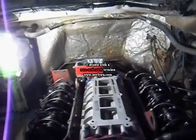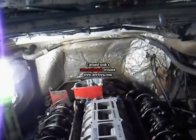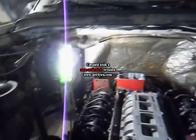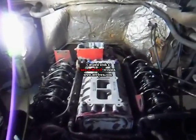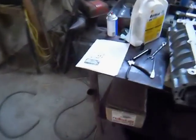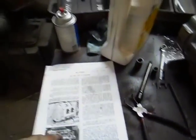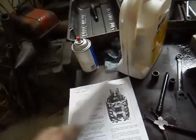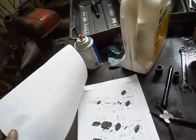Last night I was busy working on this — I put the blower in and assembled the blower drive on the end there. Right now my next step is to put in the fuel rods from the governor to the fuel injector control tubes on each side, on each head. After that I want to put the air shutoff on the blower, then we'll be starting her up to see how she's running. To help me do this, I've had this service manual — it's been a great help. I purchased it on eBay; it covers all the Series 53 engines and it's on a CD. I printed off the sections covering the blower — explains how to take it off the engine, disassemble it, reassemble it, and everything.